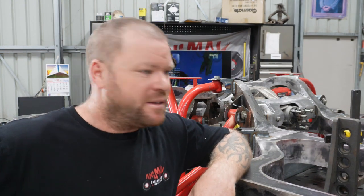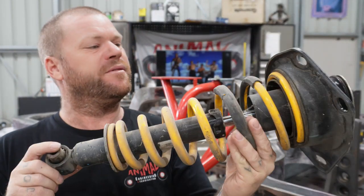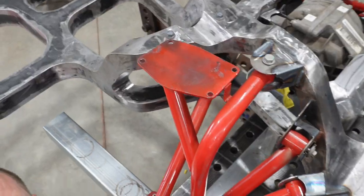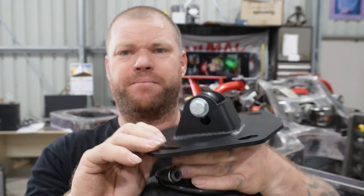I don't know if I have enough clearance to actually put the wheels on, but we'll see. We should be able to get everything else on though. So what I've got to do — this is the original shock. I believe it's already got like lowered springs in it. But basically, what I've got here is already sort of templated in the jig. And these are the air shocks I'm running. I'm going to start off with some eighth inch plate and cut out and modify that top template to match the shape of this, because I want to have full surface coverage for this — the bolt tube.